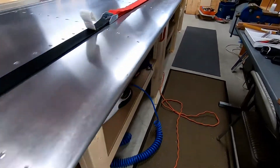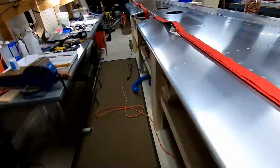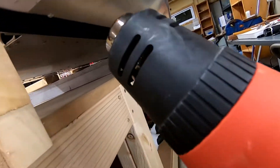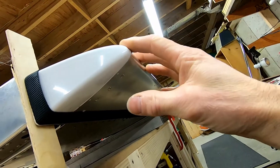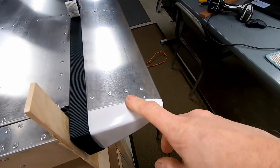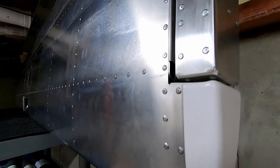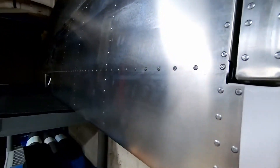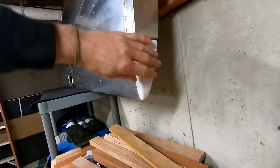I'm really happy with the way that came out. I did it on both sides and had a little gap I couldn't get forward enough, so I had these wedges in overnight. Today I took the heat gun and set it on medium-high heat, basically just warming the aluminum part — you really have to focus most of the heat there because you don't want to distort the actual plastic. That allowed it to move comfortably forward. Now I'll transfer the holes and get these end caps on. I got the end caps on both sides, riveted them in, and there's much, much better spacing now — really happy with the way they fit.